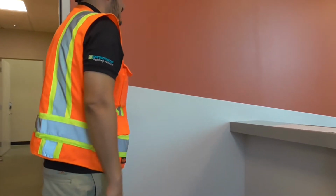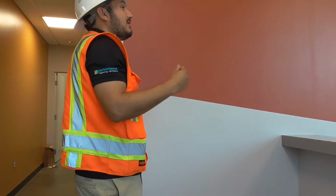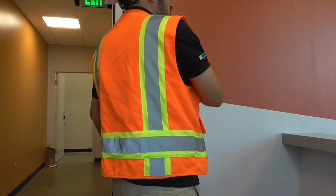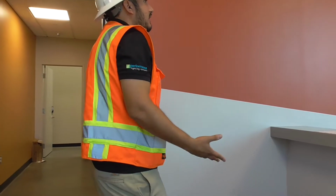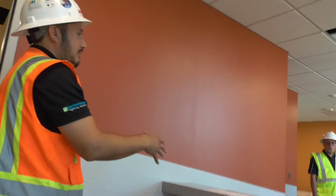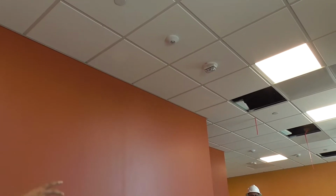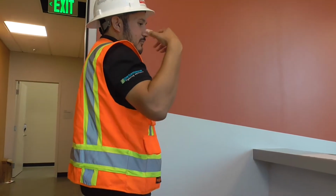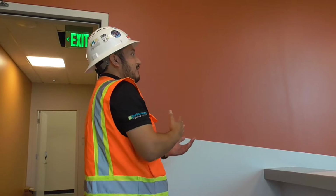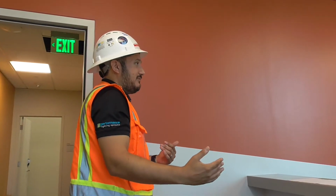A lot of these rooms, when you walk in, these sensors are passive infrared plus microphonics. The ones in the corridor are just passive infrared. When you walk in, that sensor sees you and turns the lights on from 65%. As long as you're moving around or talking, it's not recording, it's taking that noise into an electrical signal and saying, hey, somebody's here, don't shut off. When you walk away, after 17 and a half minutes of no motion and sound, the lights dim down to 1% as a warning, and at the 20-minute mark, they shut off.